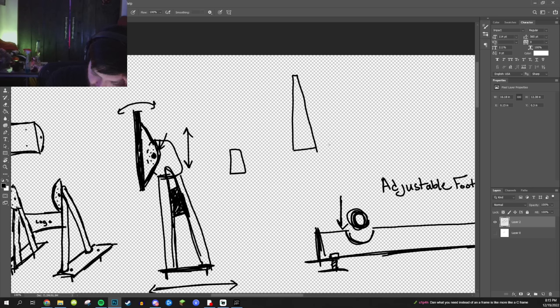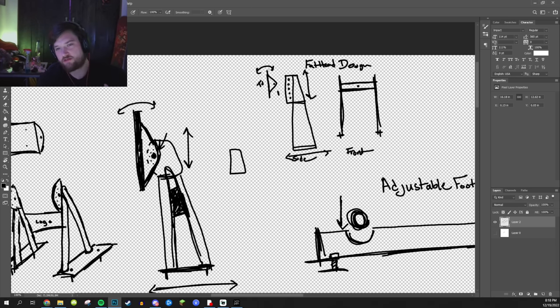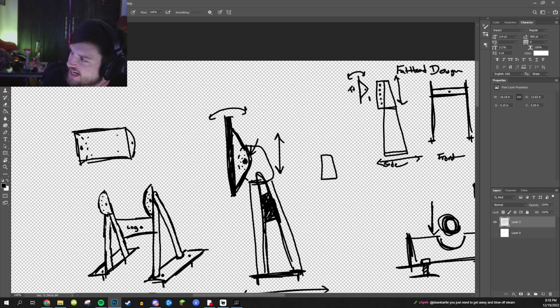All right, now I can't use the CNC machine on tubing because it's round. So instead, I'll mount a piece of plate that comes down to like here, right? Kind of covers the meeting point of the A-frame as well, and then there'll be several holes here that'll mount to here. Honestly, I think with the weight of the TV, just tightening down the bolts on the panning thing, these bolts right here where the arrow is, will be more than enough to set the adjustment.